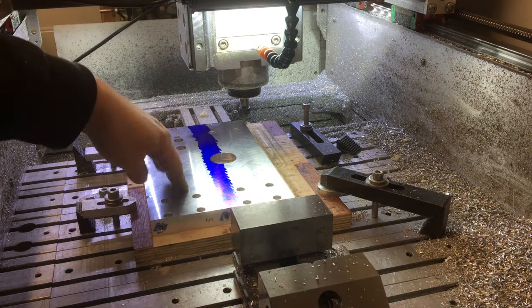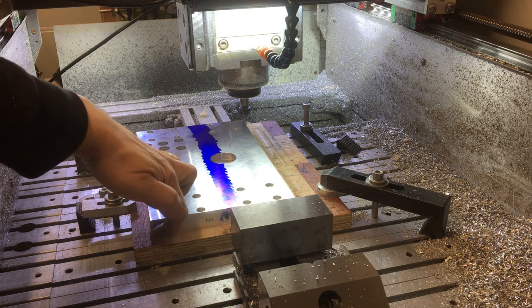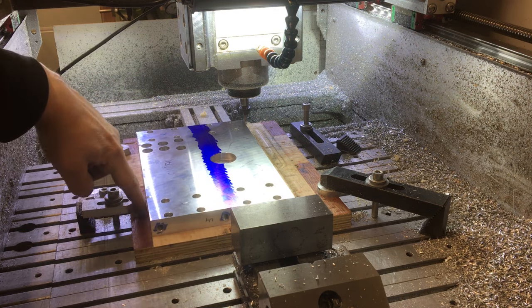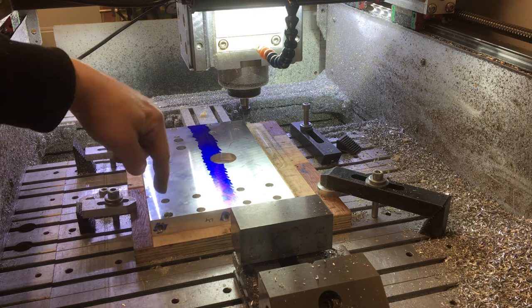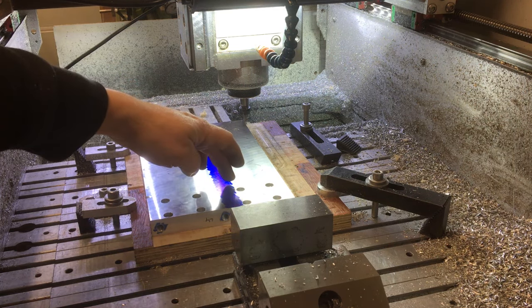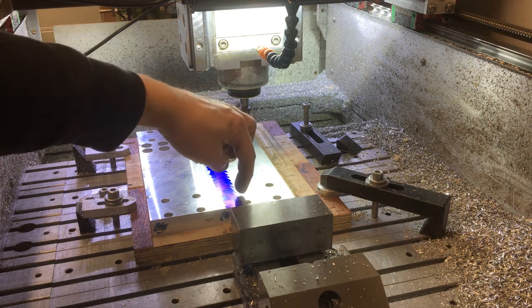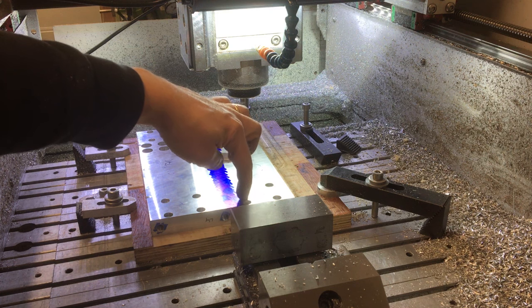Okay, we've got the rear plate bolted down now. I've just skimmed the bed to take a millimeter or two off, and that's given me this datum to push it up against at this edge. Then I'm just going to screw that down, and you can see I've got it marked out here, but we'll pick up off this edge anyway, machine that away with a little bit to leave, and then we'll come up to that line there.